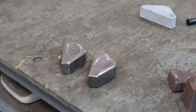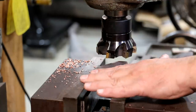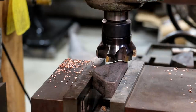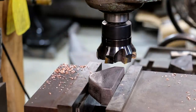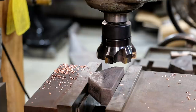We've got a face mill in the milling machine here. We're going to start by just cleaning the top of this up — I just want to skim it enough to get it to clean up. The other side has the shrink in it, so I want to take the majority of the material off the other side to get to the correct thickness to eliminate as much of that as possible. We're going to raise the table up, let's start with 10 thousandths and see if that cleans up.